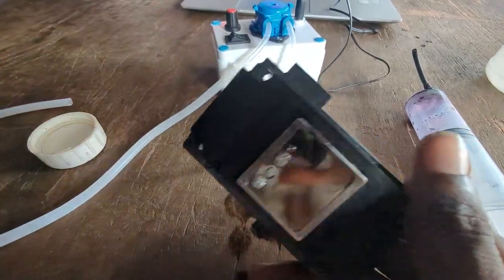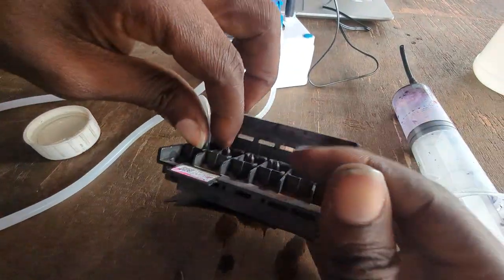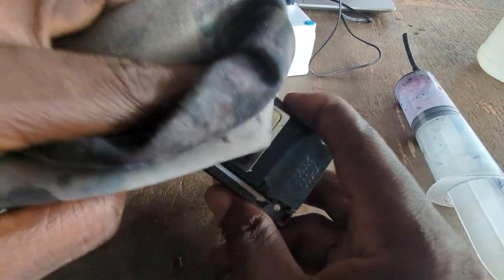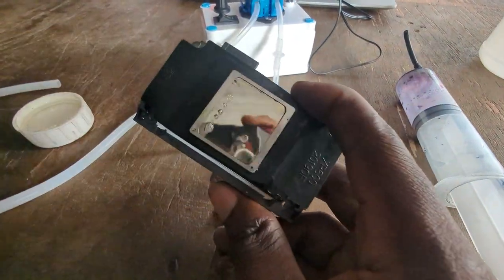It won't just wash — it will moisturize the holes. If you've ever bought printer heads before and saw some liquid on the face of the printer head, this is that liquid. It will preserve your printer head while you are not using it, so effectively the printer head is kept clean and no longer clogged with ink, and you can save it for when you need it.